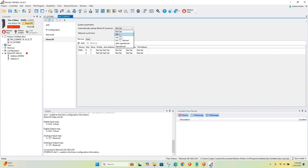We'll set the auto-start to off. This is to automatically start up the EtherCAT protocol. Sometimes — not the Copley drive, but some other drives — they require a delay, so on startup you might not want to initialize the EtherCAT network right away. TRIO recommends to have that set to off.